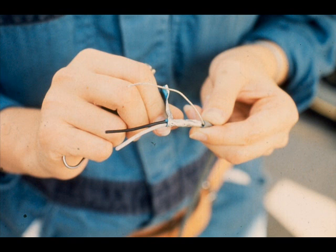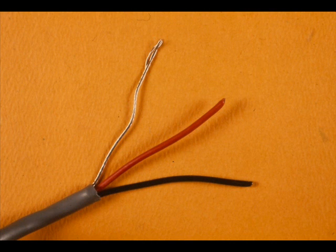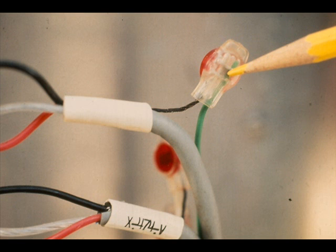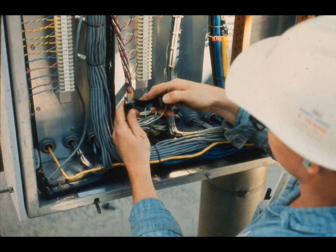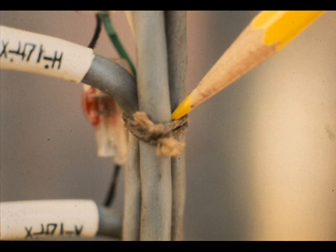Terminate the two wire cable wires. Remove about two inches of overall insulation, then remove the foil tape. Notice the cable drain wire — it is attached to a length of 16-gauge wire, which is attached to an 8-gauge wire. The 8-gauge wire is crimped to the multi-pair cable shield. In this manner, all of the two wire cable shields are tied to the multi-pair cable shield. Tape the butt of the cable after you make the drain wire connection.